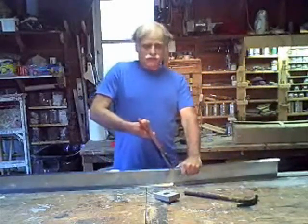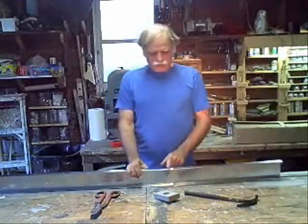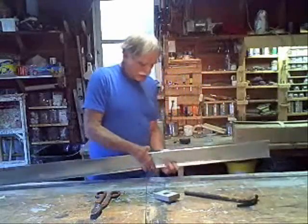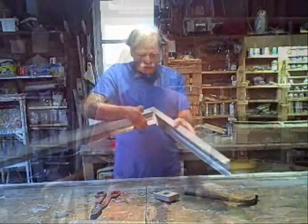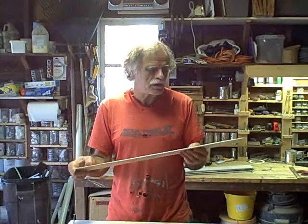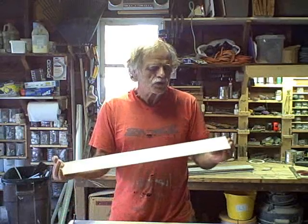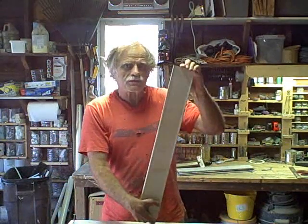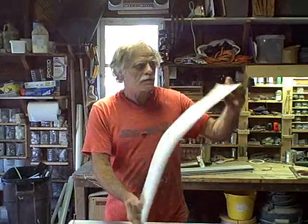We're going to cut a little notch right here. I cut a little V like this because we're going to be bending this over — this is going to be the top of our collector. We're going to need a cross point in the center of the collector when we get to it, but right now we're just going to build this thing. This is just a piece of aluminum — you could use sheet steel also. Basically, it's sheet metal. They're overlapped to give it a little more support. We're going to start off with a piece like this, about 10 inches by 25 and a half inches.